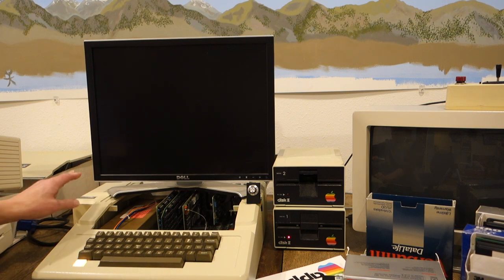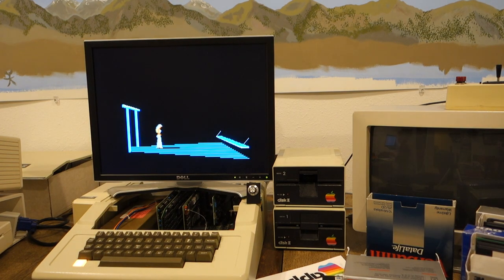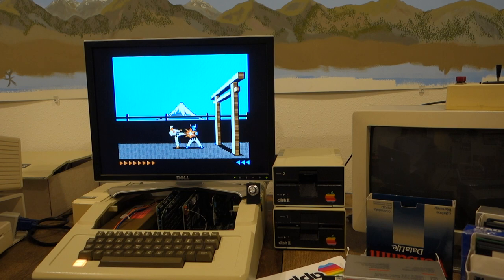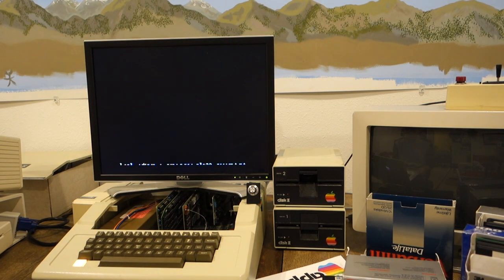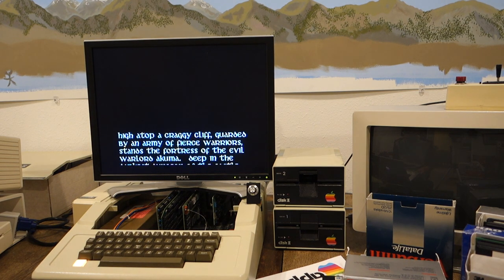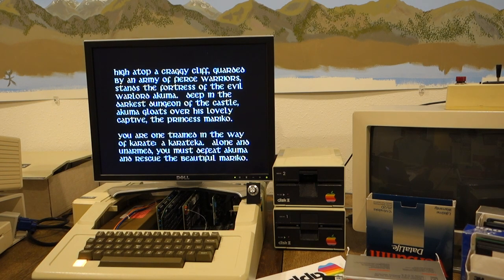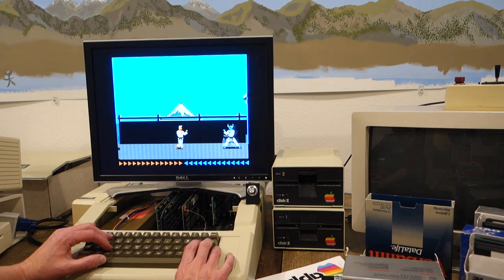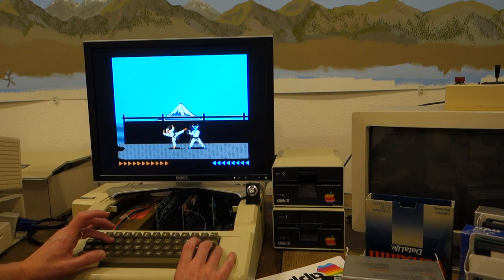Let's check compatibility with the Apple II Plus. I've got it in slot one of my Apple II Plus and we're booting up Karateka to see how that works. You can see that some stuff is really fast but other stuff is slow. Any time the card has to access ROM — system firmware, AppleSoft BASIC, the monitor, etc. — it runs at normal speed. But for anything else that's actually in memory, like a program, it runs faster. Let's go ahead and play it.